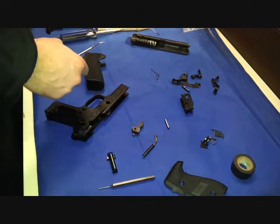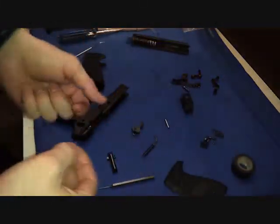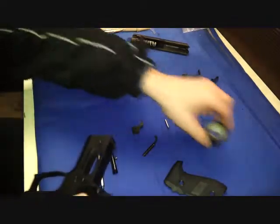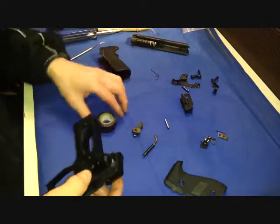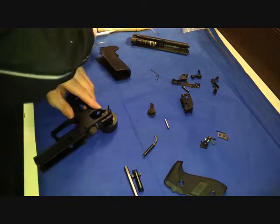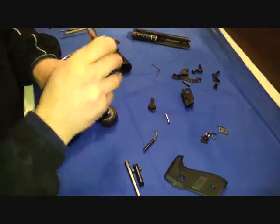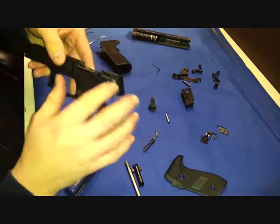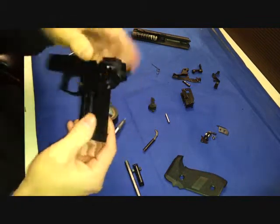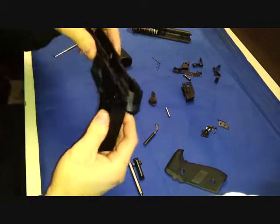What I'm going to do is remove this spring, put the block and the pin back in, because something's got to go in that space. Let's get this pin back in. To get that pin out you always want to use a roll of tape — it works the best. I don't feel like looking for my duct tape so I just grabbed electric tape I had handy, and you can just use that to pop it back in. That pin was really tight, which is good. There's nothing else to hold that pin in — with a lot of other pins you've got the slide and grips and other components that hold them in, but this pin — the grips cover it. That's a tight fit. That's back in.